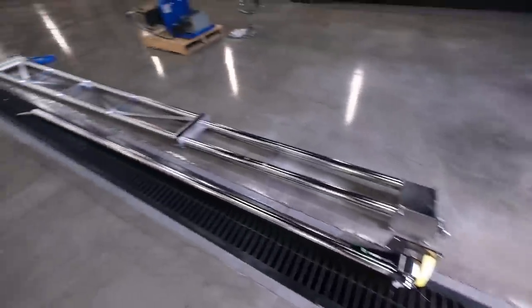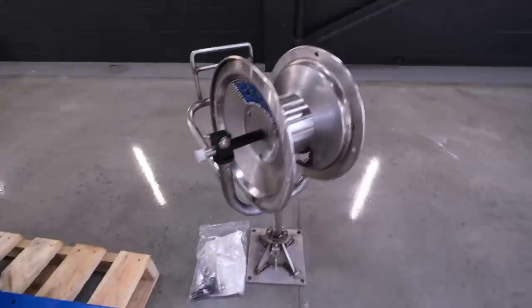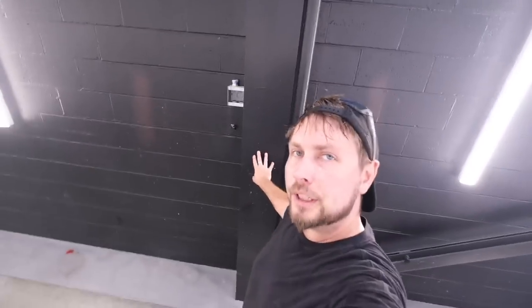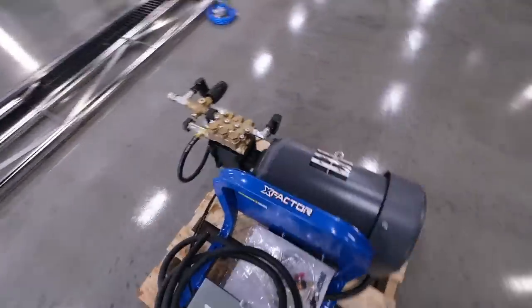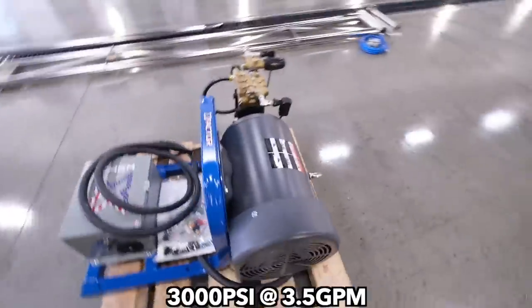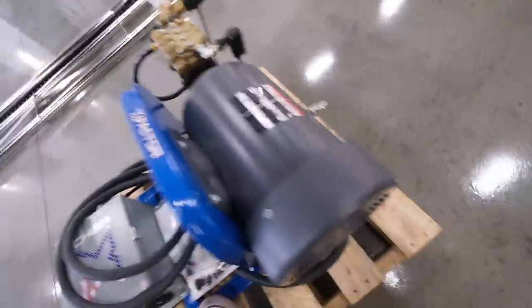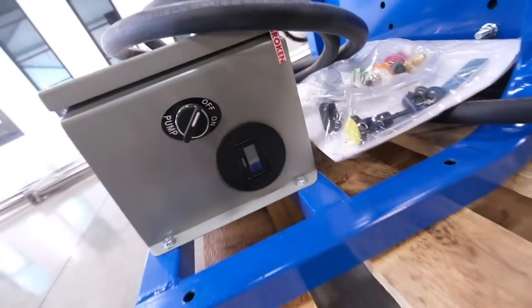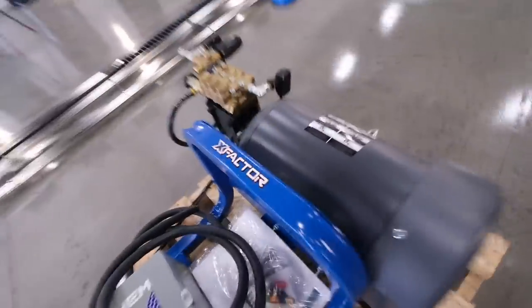That's going to be really cool to see in action. This is the stainless steel floor-mounted swivel that I'm going to put right over here underneath the power washer. I'm going to mount one of my real deal valves right here on the face of this beam, and it's going to supply both the reel and the ceiling boom. I'll have options and it'll give soap to either one — I can just choose which gun I want. This thing I'm super excited about. This is the 7.5-horse wall-mounted X-Factor. These pressure sensors operate at time-delay off-relay, so when you release the trigger it'll turn itself off. It's a giant 7.5-horse motor, so this thing's going to run 3,000 PSI at 3.5 GPM. Nice general pump, and we spec'd out an hour meter so you know how many pump hours there are, so you know when to do your oil changes.